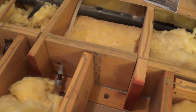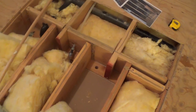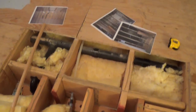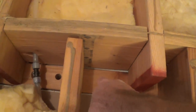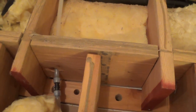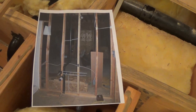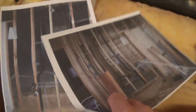We're also going to have a number of other things including some cadet heaters. I've already removed the floorboards in this attic space, and you can see the old board right there — just exposing what I have. You can see some plumbing, some vent lines coming up, a little water line, and some wires moving around underneath. Before this video started, I drilled a couple of holes — one right there and one right there. This is a one-inch hole which I'm going to run the larger 40-amp line through. I have a little advantage here because I was around when this addition was made, so I took advantage and took some pictures.